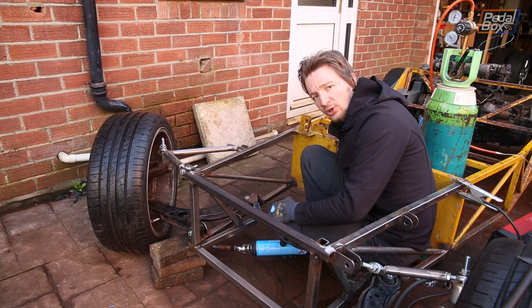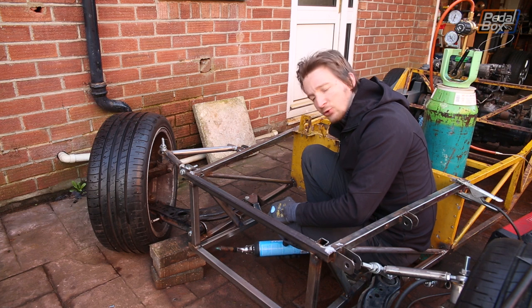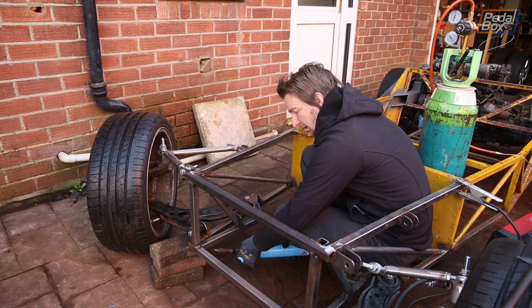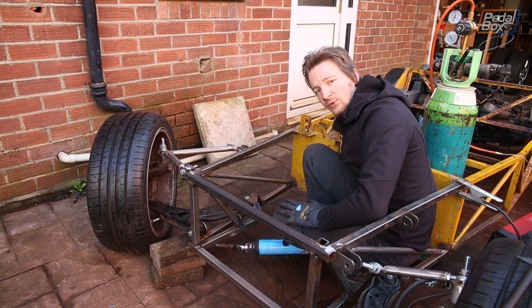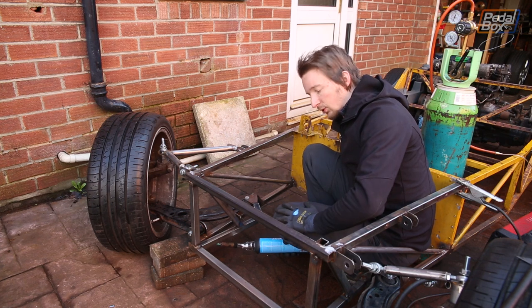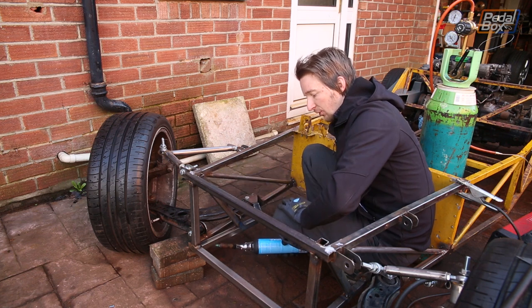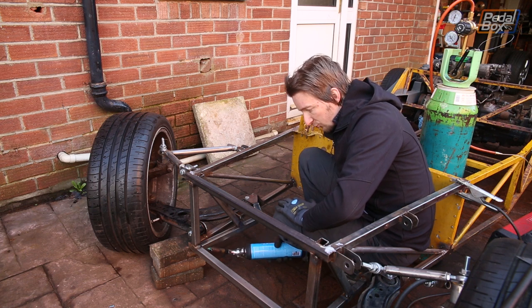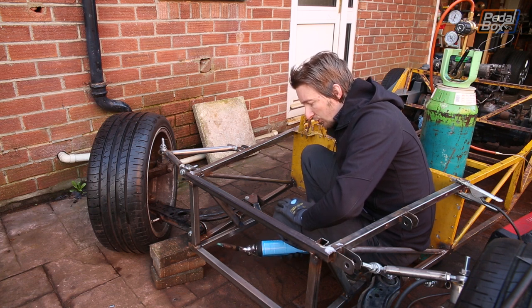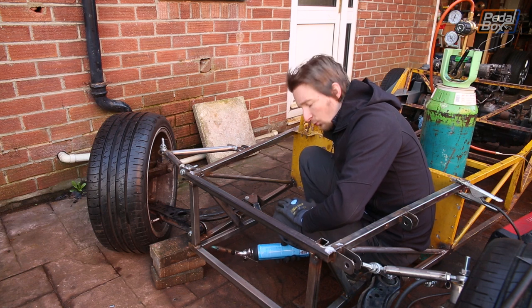We put these tubes in a couple of weeks ago now, and being the UK it's rained, so these are quite full of damp and moisture. We don't want a repeat of what's happened to a lot of the chassis tubes we're going to be cutting out shortly, where they end up full of rust, rotting from the inside out with all the water sealed up in them. Because we're about to cap them off and fully enclose them, we think it's a good idea to first heat them up with a blowtorch and drive out as much of that moisture as we can — just make sure they're dry, and then they should last quite a while.